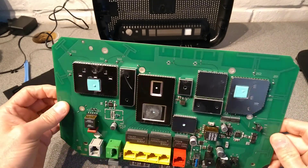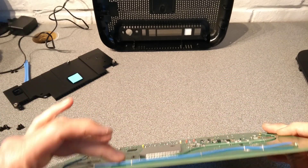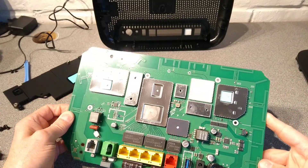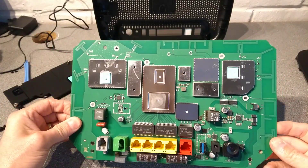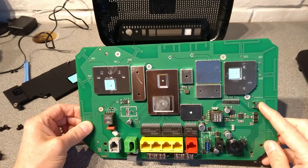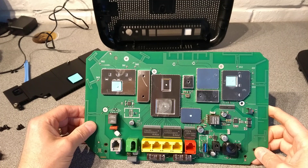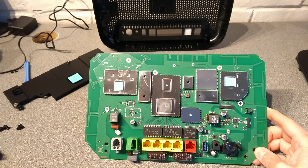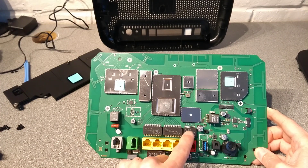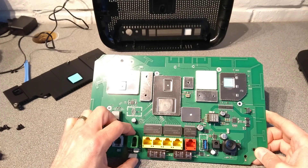And the green one looks like it's the opposite — it starts somewhere underneath this can, around here, and then goes over to around about here, probably this antenna there. Got the WPS button on the side, and two capacitors. I think those are transformers for the Ethernet, and then probably one for the WAN Ethernet there. That must be stuff to do with the VoIP ATA port there.